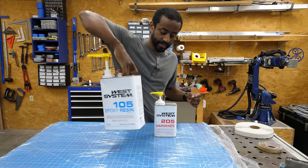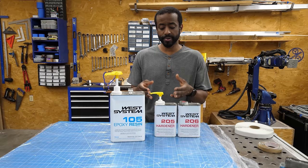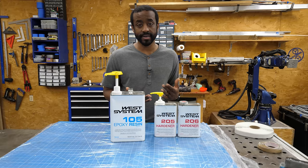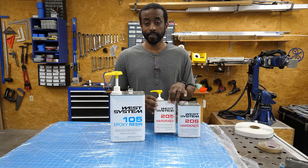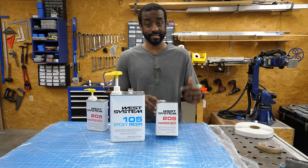The other thing to think about is the hardener — there's a fast set and a slow one. Using the fast set hardener will reduce your wait time and is better for a very simple layup where you can get the first layer on quickly. But it also rushes you — if you have a very complicated layup, the stuff will set up before you get everything in the bag. That's the benefit and the con to using the slow stuff. I have both because I wanted to have options.